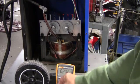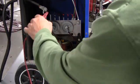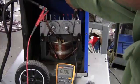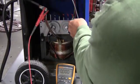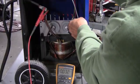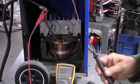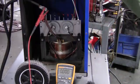So now the second test is to go to DC voltage, and we test the output leg of the transformer, which is right here, and we touch the plate, which is the output of the rectifier. We're in DC now, and as you can see, we have no output DC. As I change the rate switch, we still have no output on any leg. So that's telling me that the AC is in and the DC has stopped coming out of the rectifier plate.